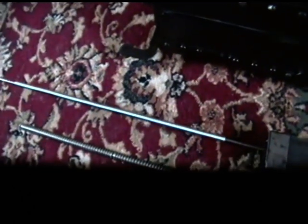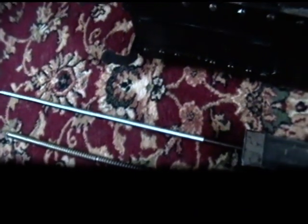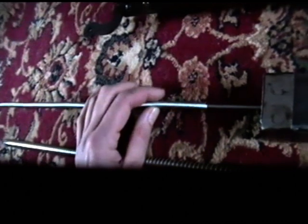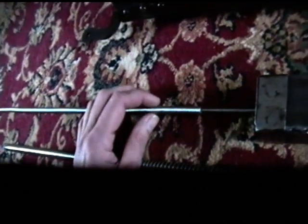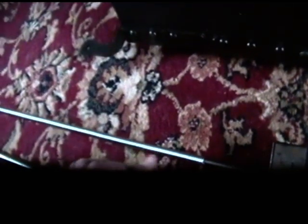Now, if you look at how springs are made, generally, at least made by people at home, they're cold wound round a former. So basically it's music wire, or piano wire, whatever you want to call it, spring wire, and it's clamped at one end, and then it's basically spun and wound down a former.